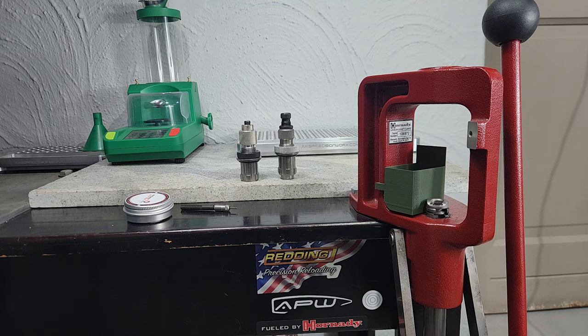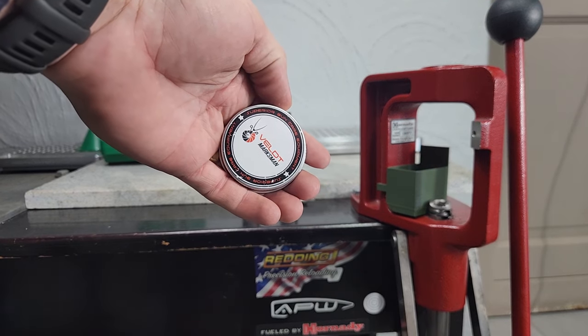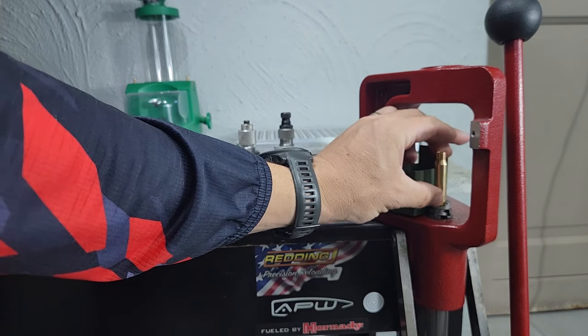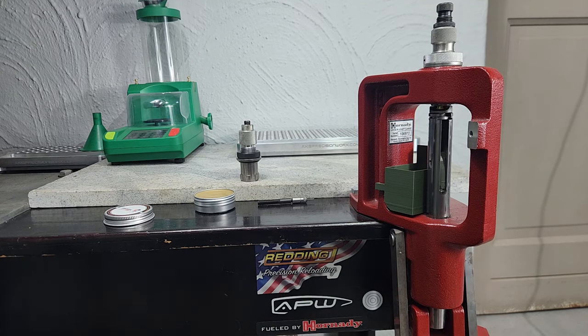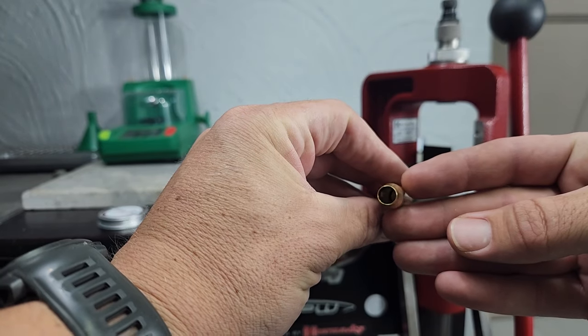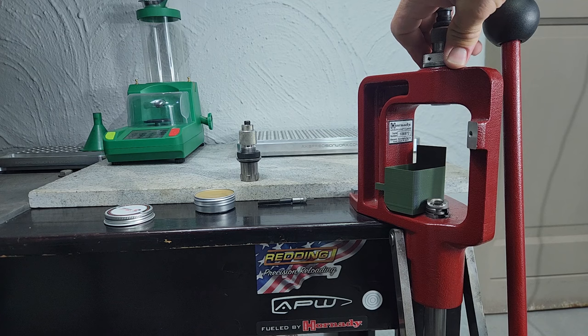For the close-up: here I've got my Hornady Classic Lock-and-Load press. I've got my two dies — on the right-hand side is my neck-sizing Type S die, and on the table I've got the expander ball that can go inside the die, and on the left I've got the expander mandrel which I use. I'm doing a full-length sizing on the brass using felt case lube. We put a little lube on the brass, run it through the die — nice feature of the lock-and-load press is the turrets just lock in. It's now full-sized, the bushing inside has done its work, and any deformities on the case mouth are now gone — it's nice and round.